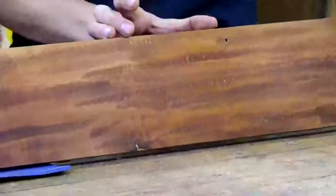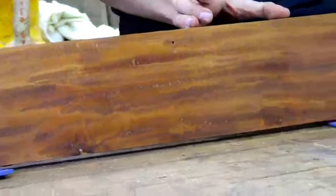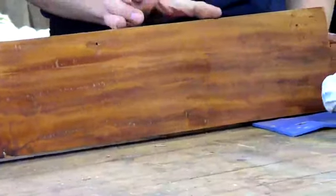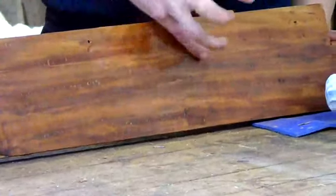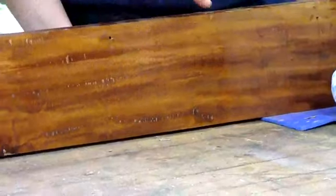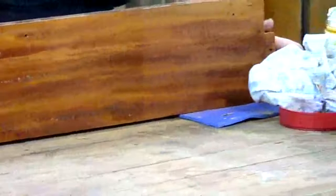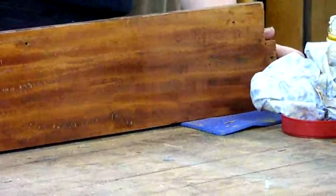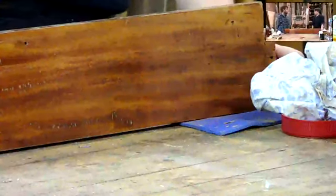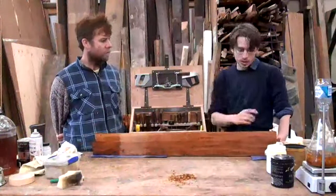Here is the shellac with the wax on it, which is the highest sheen for what we've done so far. Here's the shellac that's just polished in, which has got a good feel. Keep tilting it towards the camera. And what's the benefit of having the wax on the shellac versus not having the wax? The shellac protects the wood, and then the wax protects the shellac, and it also adds a higher polish finish. And then your last one is your brush shellac.